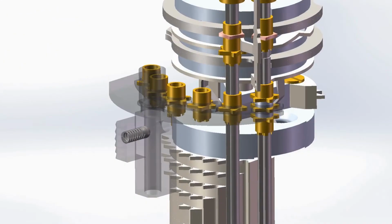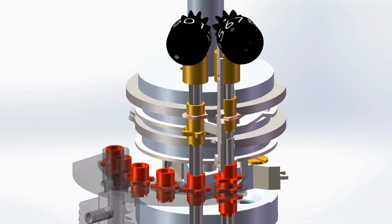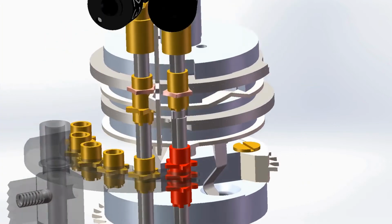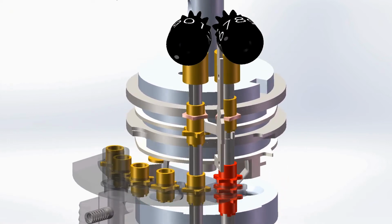The lever contains the reversing lever plate, which slides 6 count gear assemblies along their transmission shafts, which, through transmission gears, drive numeral dials as described earlier. Note that the rightmost count gear assembly contains 3 count gears as opposed to the one on every other. In incrementing mode, the bottom count gear in this assembly is turned by a single tooth step drum plate in a set of plates opposite the result set. We'll call this the turn set. None of the other count gears mesh with these plates in incrementing mode, and so 1 is added to the turns counter with each revolution of the crank.